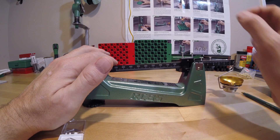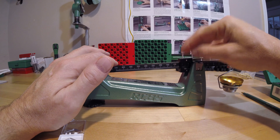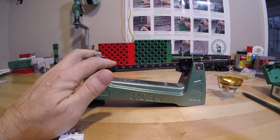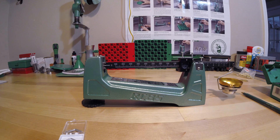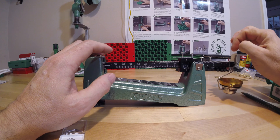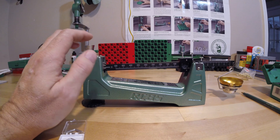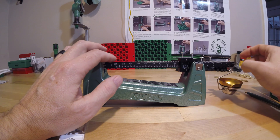Here is the 20 grain cylindrical weight. I'm jumping the indicator over to the fourth tick mark to see where it settles. I believe this is one I checked before and it was slightly high — the pointer is indicating the bottom of the white line instead of the middle of the white line. I have two of the 20 grain weights and both checked slightly high. Moving this over one tenth of a grain, the scale now settles on the top of the white line — indicating about half of a tenth of a grain off, since the midpoint between bottom and top of the white bar is roughly half a tenth.